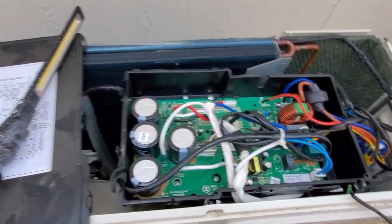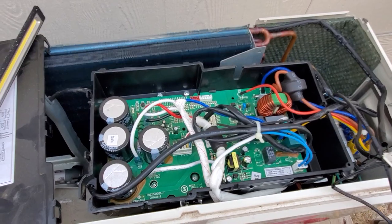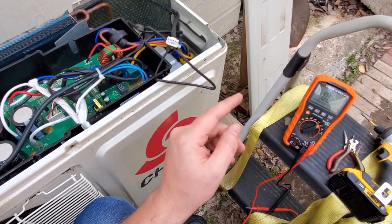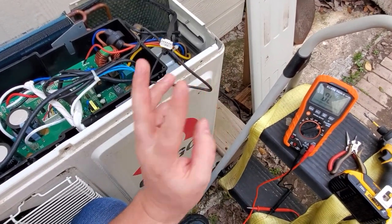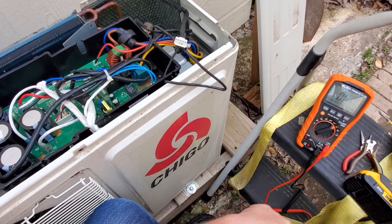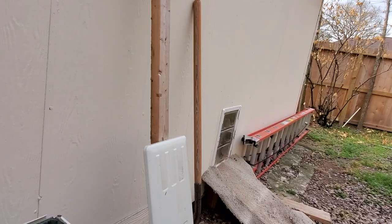Anyway guys, I hope you like this video — my tragedy, you might as well learn something from it. Do not automatically trust ohms or resistance on your multimeter. If you can, put some current through it and put it on diode mode. Remember: when you're on diode mode your probes are polarized, so try reversing the probes. Thank you for watching — I know it's a brief one, but this was a perfect opportunity to show you that there are different modes on your multimeter you can use every day to help troubleshoot weird electrical conditions, like a temperature probe where resistance is always changing based on temperature.